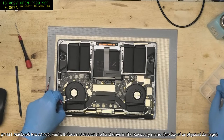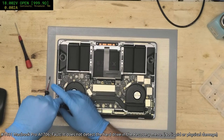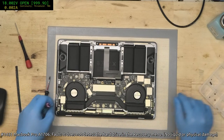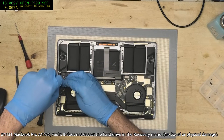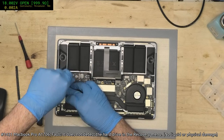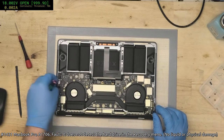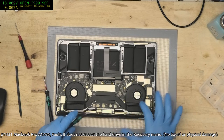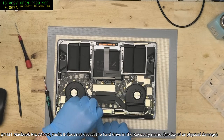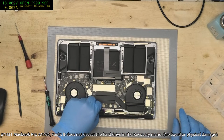Derek Chun is going for the Piccolo. Yeah. I get the occasional Piccolo job. They don't happen too often around here. But it is nice when you do encounter one. I think the hardest thing about the Piccolo job is a lot of the time, at least for me anyway, I don't tend to keep the Piccolo regulators or PMIC controllers on hand too often, or I forget to restock after I've used mine up. And so then you end up scrounging around the workshop trying to find a working Piccolo chip.